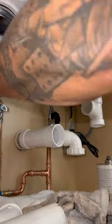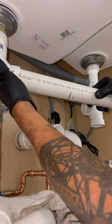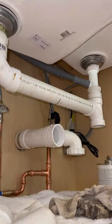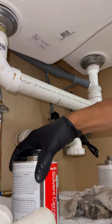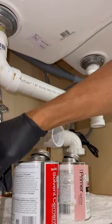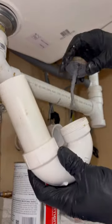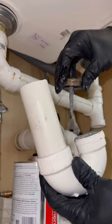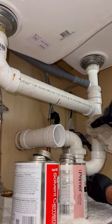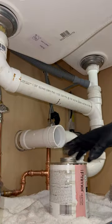I also add dope to the ground joint because that's how I was taught. I've worked with at least 300 plumbers over 15, 17 years — there were always about 110 to 130 people in the company I worked for — and we all put dope on the ground joints. That's what you did. I don't care if you don't do it, but I do it. If you're just learning and watching my videos, put some dope on those ground joints. You won't get a callback — it just helps seal. Nothing's made like it used to be. I believe the dope fills those cracks in 2023 fittings.